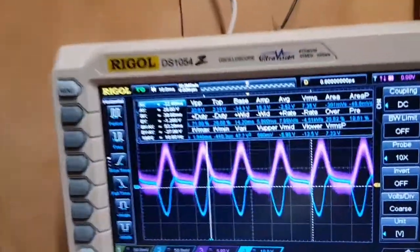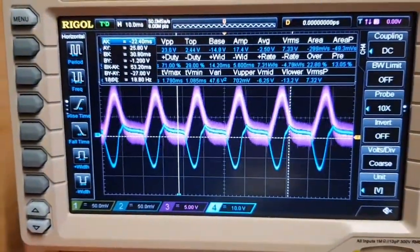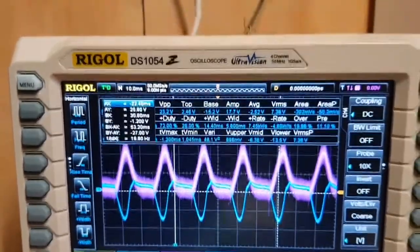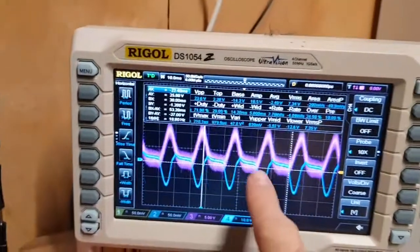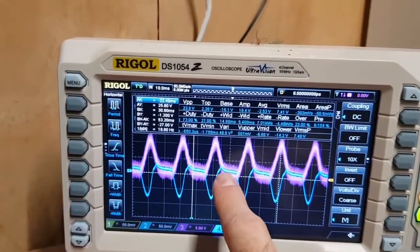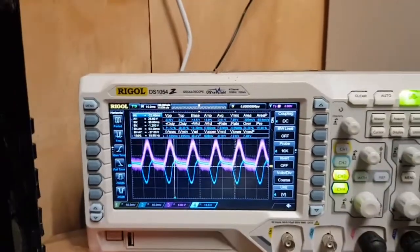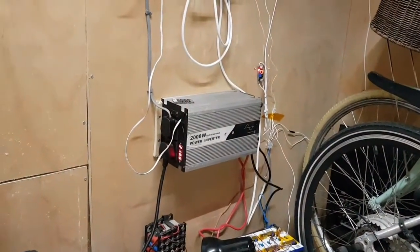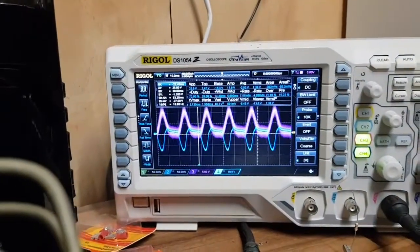If you look at the scope probes, that's not a very clean sine wave. And this is on the output. You can see here you've got a very flat bit, but what you'd expect is a very nice crisp sine wave, and these two bits don't join up. So I think that's what's causing the distortion. This sine wave has been produced by that inverter over there, so maybe that inverter is not giving out a nice clean sine wave, and that's what we're hearing on the radio.